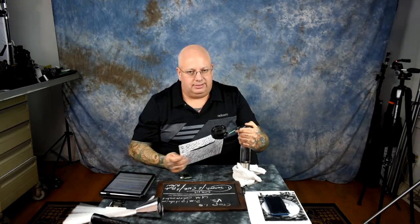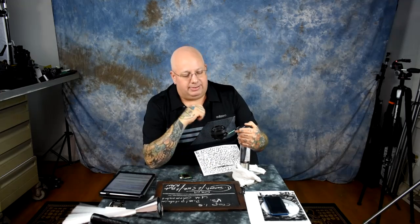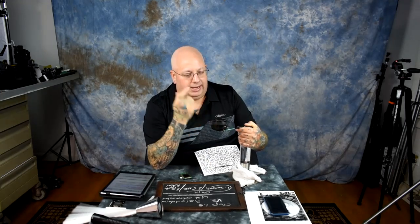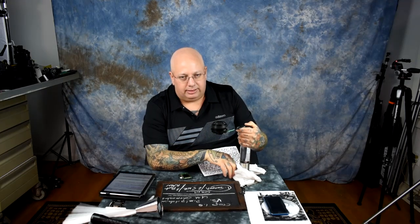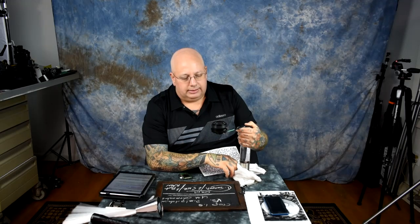We care about the gain at each photo site. It's not a satellite dish — we're not receiving signals from outer space. It's not a magnifying glass. Well, the lens is the magnifying glass, and more light there is obviously important — you want a lens that gathers more light, you pay more, you get better depth of field, better bokeh. That matters at the lens. It doesn't matter at the sensor.